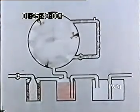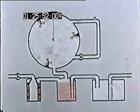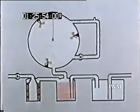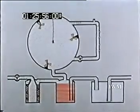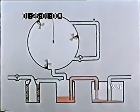The sampling arm is also sterilized by this process. The liquid condensate collected is pumped over into the sterilizing vessel, where it is sterilized by steam under pressure before being discharged to field drains.